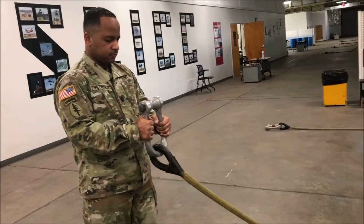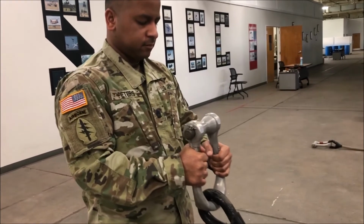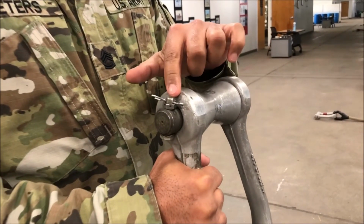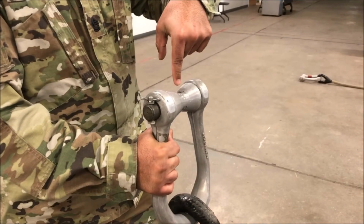After verifying ALS, continue your inspection starting with the apex fitting. Ensure that the apex is set up for the appropriate aircraft, that the castellated nut's crown portion is facing out, and that there is a cotter pin present. Incorporate an apex spacer if the aircraft requires it.